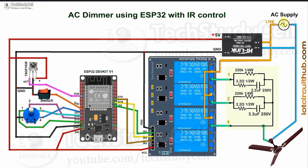In the circuit, the AC supply live wire is connected to the AC-to-DC converter to provide 5V to the ESP32 and relay module. The live wire is also connected to the common terminal of the first three relays. We use capacitive reactance to control the fan speed. For step one, the first relay turns on and we give maximum capacitive reactance to the fan. For step two, the second relay turns on and we increase the capacitance value, which reduces the capacitive reactance and increases the speed.